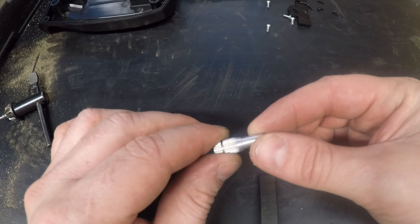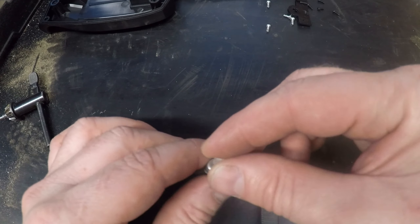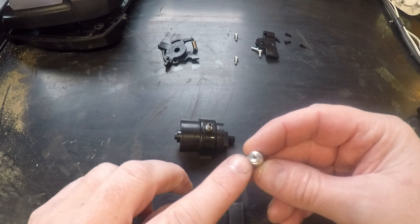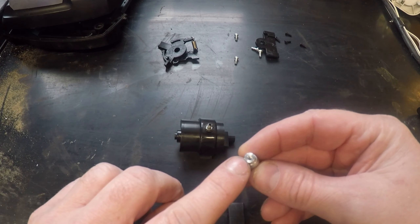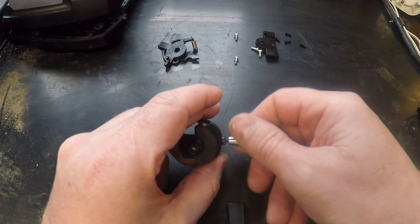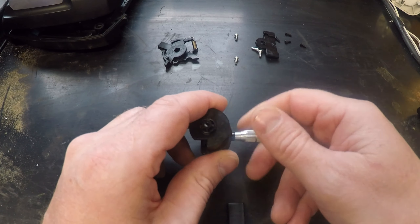That's step one done. Then what I'm gonna do is exactly the same with this — cut it down, make it a little bit shorter. You can use different thumb turns if you want. Then drill and tap that, and screw it onto there. We've drilled and tapped that M3 thread — two-and-a-half millimetre drill bit first, then use the tap to put an M3 thread on there.